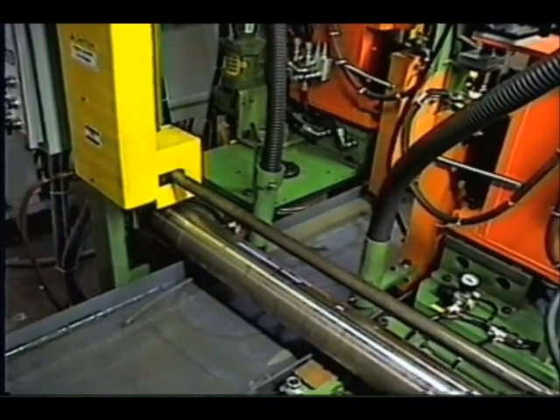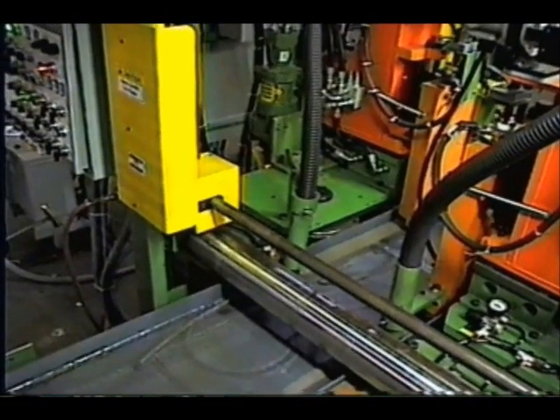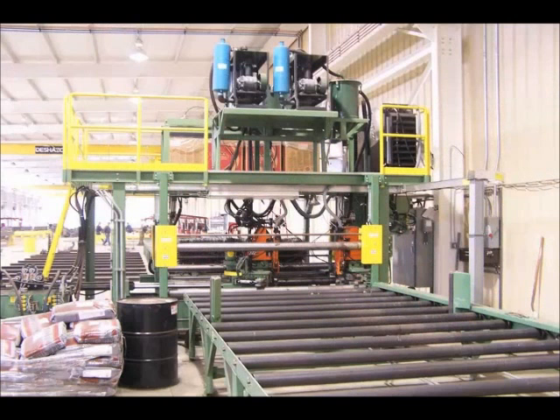The flux delivery is integrated internally within the main weld head. Flux control is done with a hardened rotary pneumatic shutoff valve immediately above the drop point. The PTW-72 has a large overhead platform designed to support four 1,000-pound Lincoln wire packs or drums. The overhead platform also supports the flux recovery system, which takes unused flux and returns it to the primary separator for reuse.